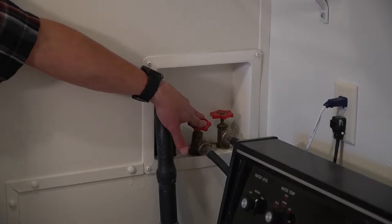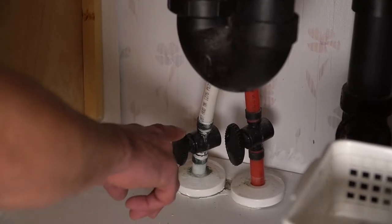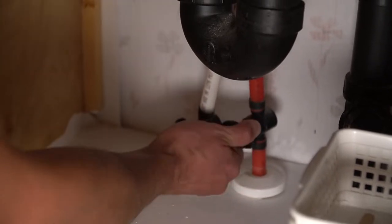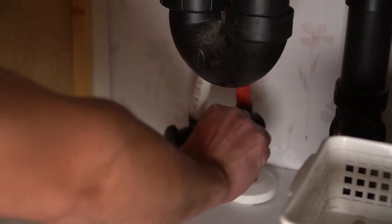It is very important inside the home to not have any water leaks. Water can damage your floors, your walls, and the insulation inside both of those structures. If left too long with a water leak, mold will grow and it will be a big problem. It's important to know where the shutoffs are at all of your appliances — here are the two laundry shutoffs, hot and cold. Under the sinks, next to the toilets, and any other fixture typically has a shutoff accessible in a cabinet or next to the faucet. To turn them off, simply turn the knob to the right; to turn them on, turn the knob to the left.